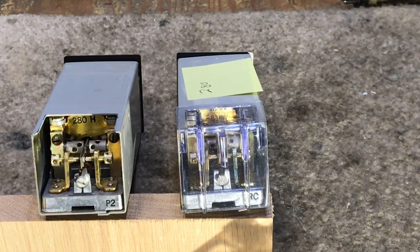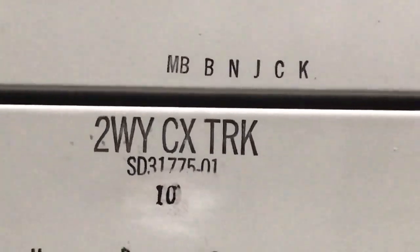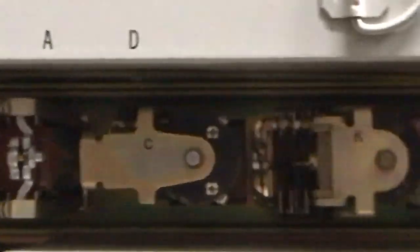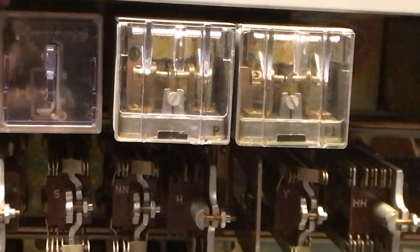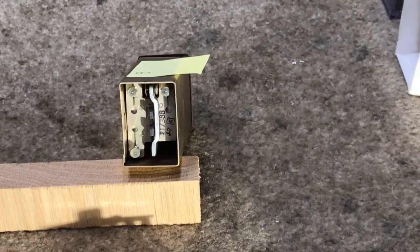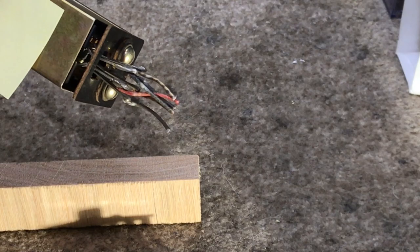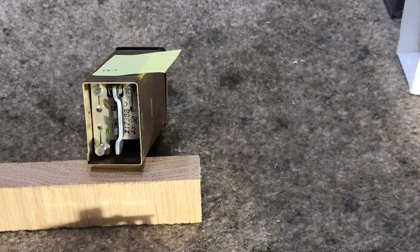These things operate very fast and are very sensitive. I will show a couple of trunk circuits that have them in it. This is one of the trunks I have showing different types of relays and the loop sensing relay. We have the 220 series relays and some of the E and other type relays, as well as the 280 relay used for very sensitive detection of change of state on the circuit. Here are some more sensitive relays in a coin trunk. This is a B type relay, used on 3CL trunk circuits, and this style relay was used elsewhere as a sensitive loop relay.